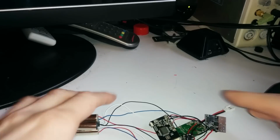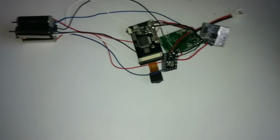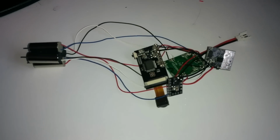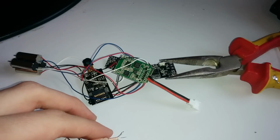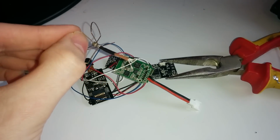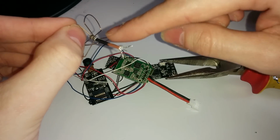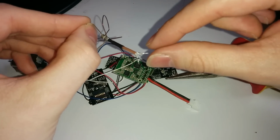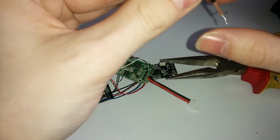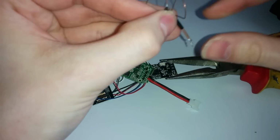And so, after all this time, what do we end up with? A big flaming mess of wires. Trust me, it should work. The antenna should be fairly straightforward, famous last words. You've got 3 pins, which is the center pin, and then these 2 bits here are just the ground of the coax. And then they just slot into here like that. And then you solder it all in. That's the plan.